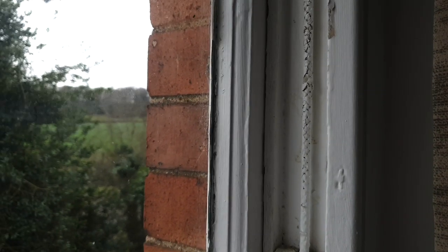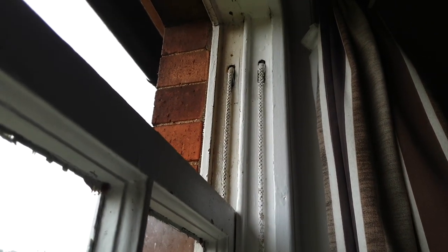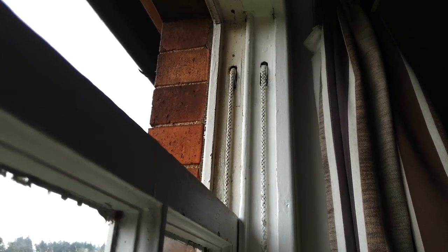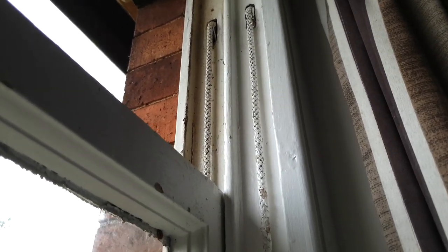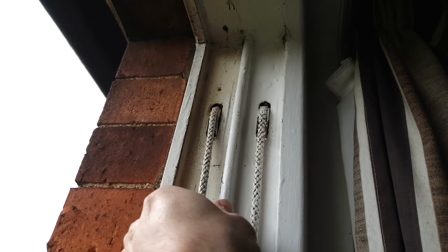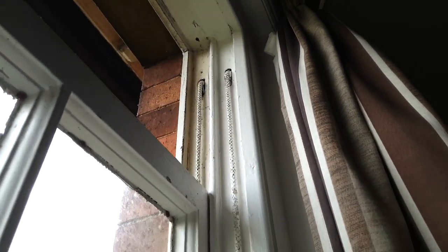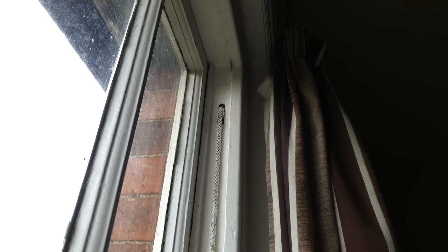For that reason I'd always measure the outside sash width — it's kind of fixed; you can't alter it other than rebating the parting bead or rebating the sash over it. That's the one to check for your thickness measurement. At this point you also want to check that the pulleys are working on all the sashes. We can replace them as necessary when refurbishing, though I'd rather leave things original unless someone specifically wants a new brass pulley.